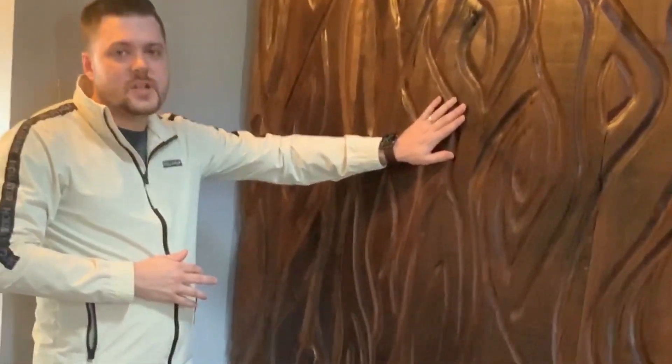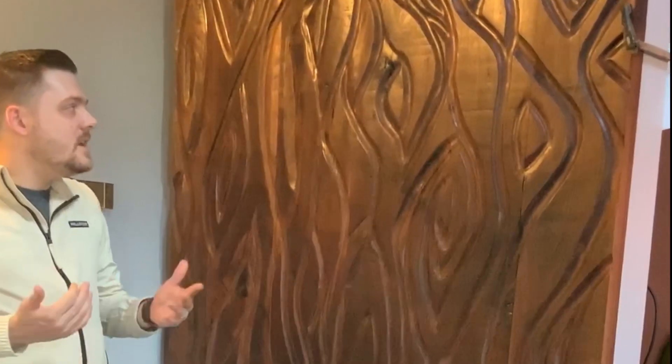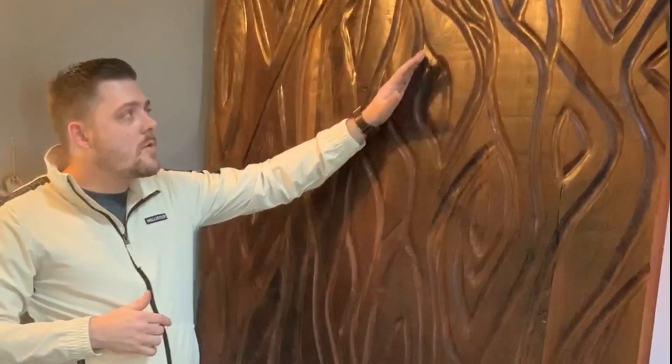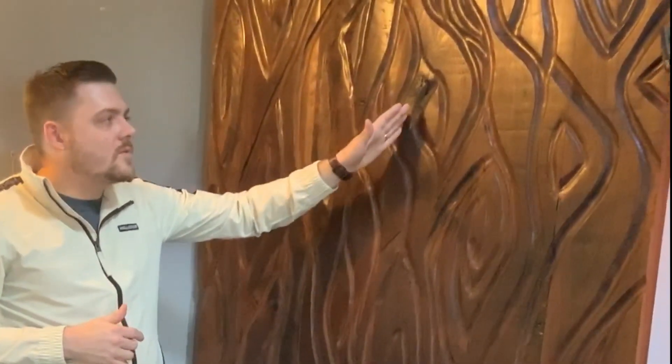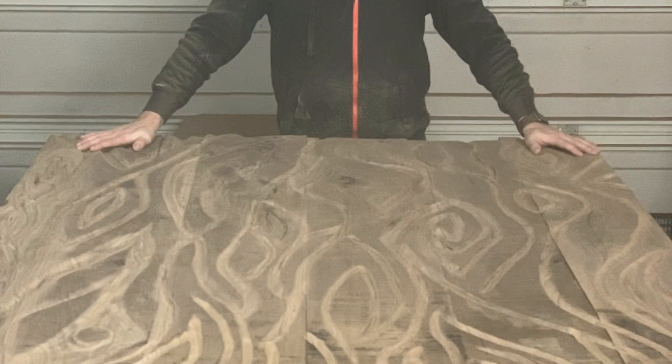On the table I knew what I wanted and just went for it since it was a simple shape. On this door, if you're doing a design like this, I suggest you do a layout. I did it in sections and used Sharpies, white crayons, and white pencils — things you can get from Hobby Lobby, Michael's, or any woodcraft store. You need to figure out what kind of person you are: do you carve where you put the line, or carve around the line and leave it as a ridge? For me, I carved where the line was and left the space in between.